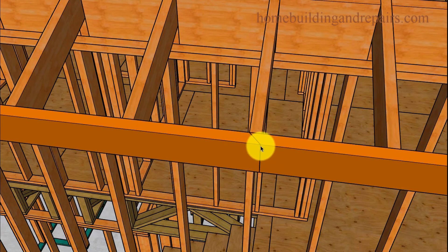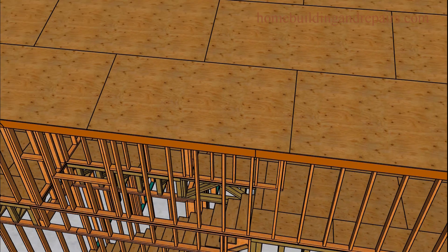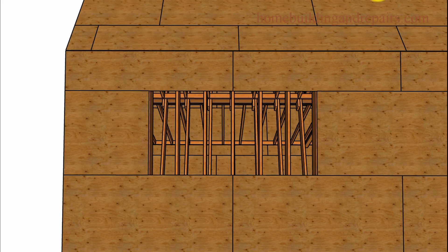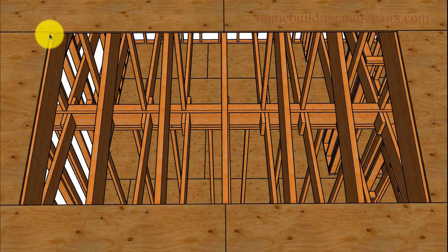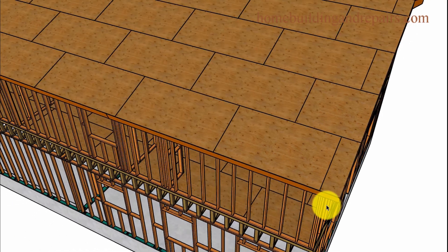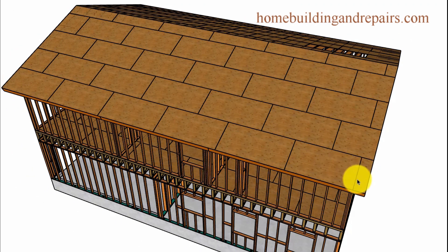The brake in the fascia board is usually a 45-degree angle, though it can even be a 15-degree angle — I've seen it done a variety of ways. Now let's put our roof sheathing on. All of the roof sheathing will break and be staggered, breaking on top of the roof rafters half-on and staggered. Pulling a sheet of plywood out: it breaks half on the rafter, and the next one breaks half on the adjacent rafter. Note that small pieces may not be allowed — some engineers require a minimum sheathing piece size in both directions, maybe 24 inches, which means you'll be wasting some extra plywood.